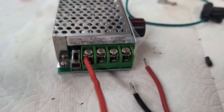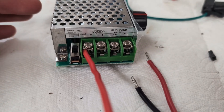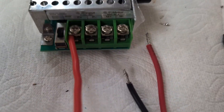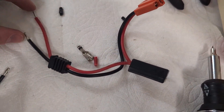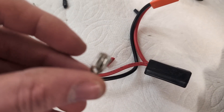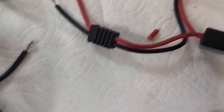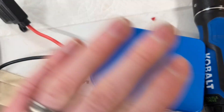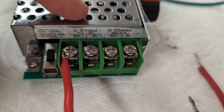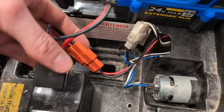Let's come back to this one and get it all connected up. We've got our station set up to wire this. This little controller is great because you don't actually have to do any soldering. I did have to strip the ends of the wires — this one came with the car and had little connectors to clamp onto the six-volt battery, and the other wire going to the drill battery also just needed the end stripped.